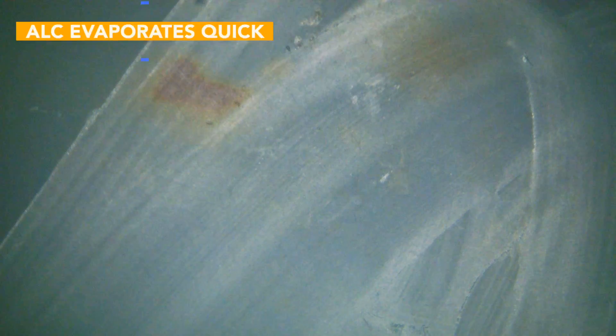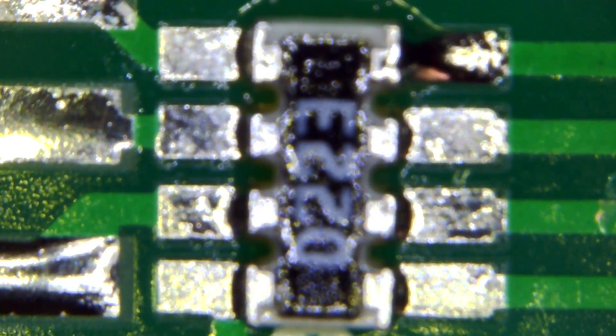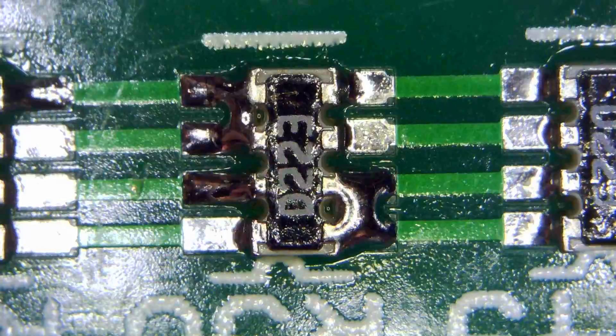Let me take another look again. We're going to go down a lot and look at the microscope in a better way. Then we go full one by one. Here it starts — this one is good. This one doesn't have enough solder and has two shorts. See that? So the R50 has problems, as we can see.